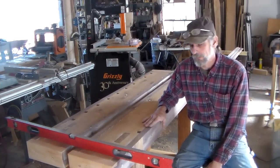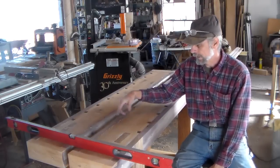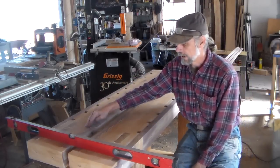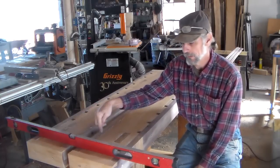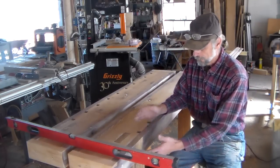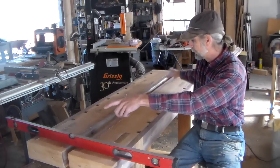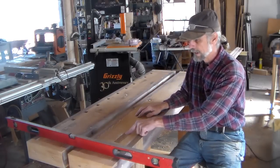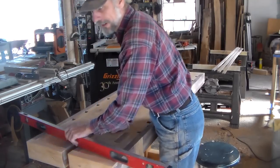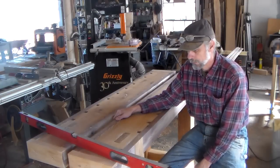Okay, so I'm a bit of a goof sometimes. The last thing you saw was me wedging the top down. I had the clamps up there. Let me explain that a little bit. This top was sticking 5/16 that way, and this one was 5/16 long on that end. I guess there was some twist in the overall legs, so I was able to put those clamps on there, and when I wedged the top down, it stayed, and it's maybe a 1/16 out now, so it'll work. It's a workbench, right?